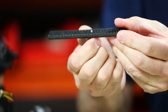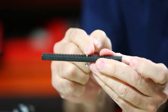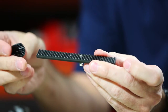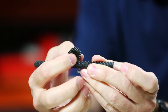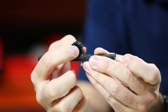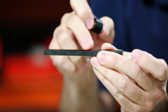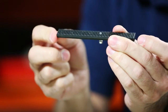I've actually put in a screw that's way too long — you can see it threaded through the teeth in the rack. Sometimes if you're not careful with the screw you're using to attach the rack to the channel, if that gets up too high, as I roll this across you can see that when it gets to those high points where the screws are, it creates a bump that causes jarring motion. So make sure the screws are not threaded up into the teeth of the rack — that's the first thing to look for.